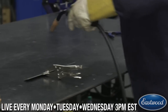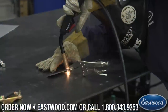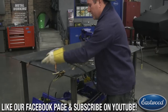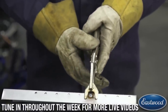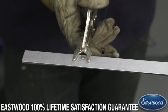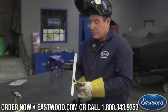I haven't even looked at the machine — we're just going to hit the trigger and then show you guys how to diagnose this and get it set up. So there's our first one. You can see it's pretty flat there on the other side, but we can either turn the temperature down just a little bit on our machine, or let off the trigger a little sooner — either one is just fine. We're burning through a little bit there, but we did not blow a hole.